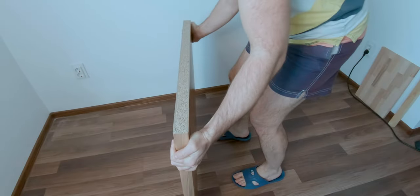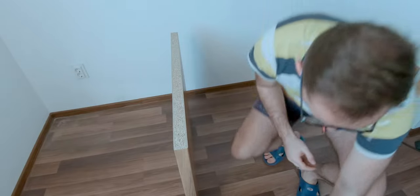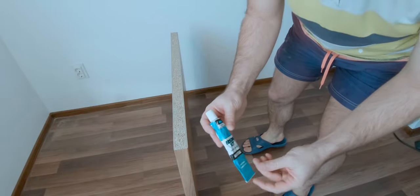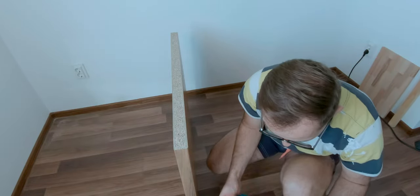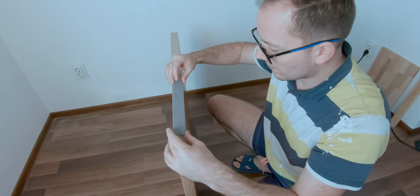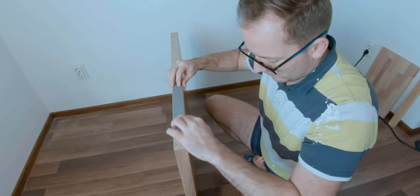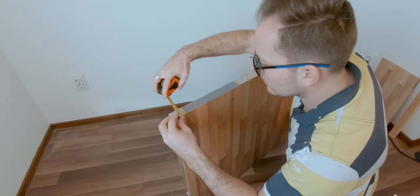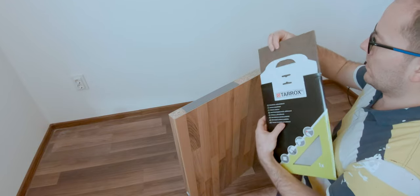As mentioned in previous episodes I had the boards custom cut and because of this there were small deviations between the wanted and actual sizes. One such example are the cabinet side panels that were cut from the same piece as the workbench, but one of the pieces ended up being shorter. I fixed this 2mm difference by gluing a piece of plastic with a 2mm width to the bottom of the shorter panel.